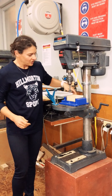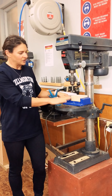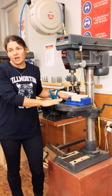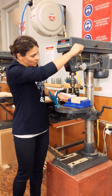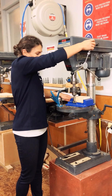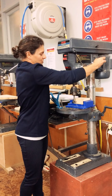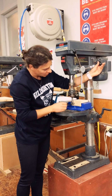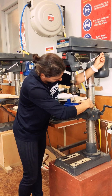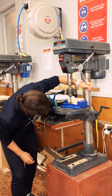That's set. The other thing that I need to set on this is the depth, and I'm going to do that in advance by changing on this drill the height of the machine bed. So I'm going to pull that down so that this doesn't go all the way through the clamp we've got the work in — that this stops that flat-bottomed hole at the depth that we want. I've had that already marked on here, so I'm just going to have a look, and it's about there.